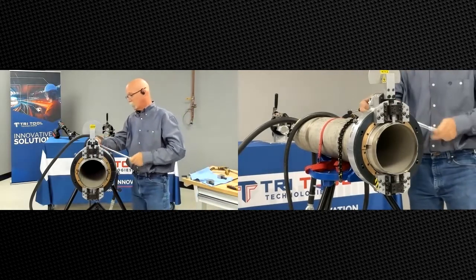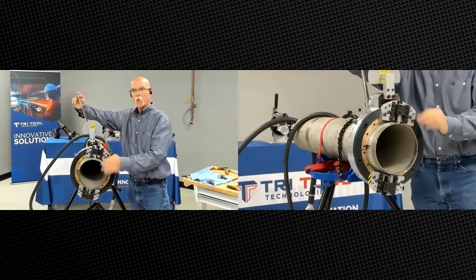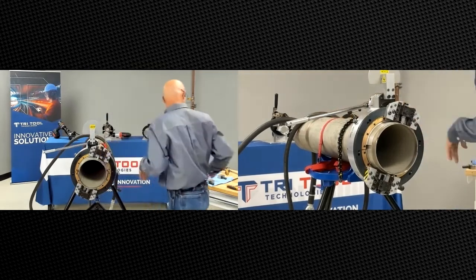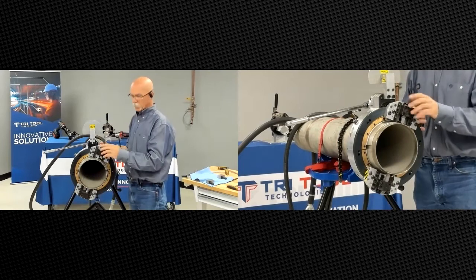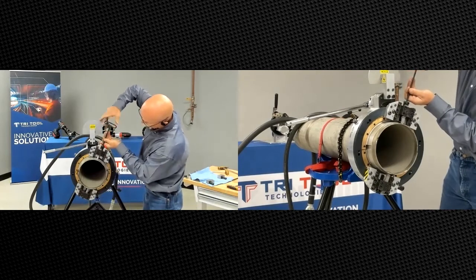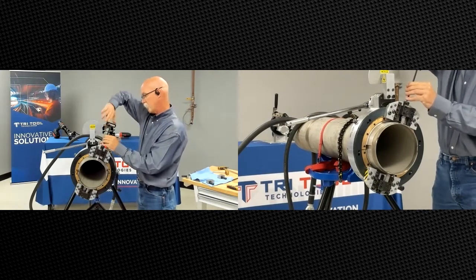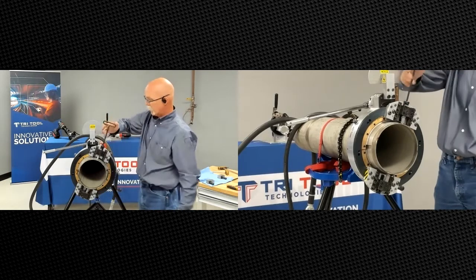The next step is to look for the highest location on the pipe or tube, and also be aware if you have a seam — you want to find that spot. We're going to use the star wheel wrench on the star wheel that actually feeds the machine in radially. Go down, touch that spot, then back it up and bring the tool bit away from the pipe three turns, just for safety so we don't run into anything with the ovality.